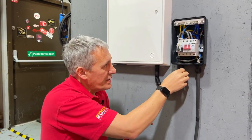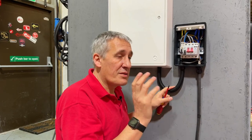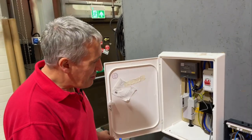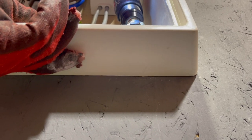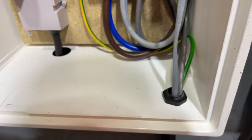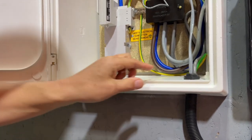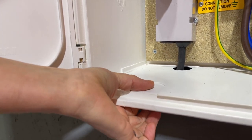This box isn't going to twist, so you shouldn't have any trouble making connections. To fix it to the wall there are screw knockouts in the back — just remember to put the waterproof screw caps on them to maintain the IP rating. Now, into the meter box — a grey area on how you make cable entry into the meter box itself. We've gone into this corner where there was a suggestion in the moulding of an entry point. We drilled a bigger hole underneath to bring the conduit through, and a 25mm hole in the top to terminate the gland. We avoided the wafer-thin points where the hockey stick would come in.